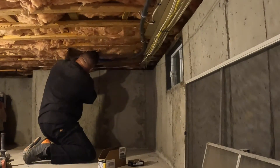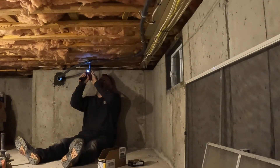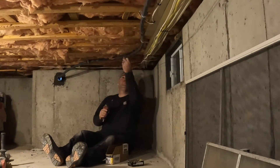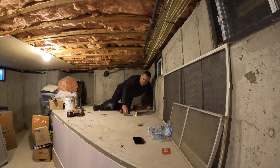The code does allow for larger cables to be directly attached to the underside of the framing members — these floor joists. I believe it's larger than number 6, so above number 6 you can attach directly to the bottom of these joists as long as they're not subject to physical damage. You can see on the right side there are running boards, which are pretty cool to avoid drilling holes in the framing members.